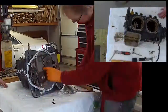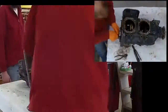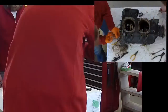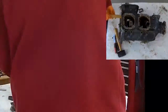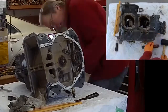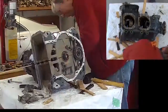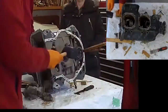Got the accessory case housing off, pulled a couple of little details off of there — just a little tap tap and it came off. Got the hidden bolt behind the cam and then the bolts on the bottom of the case, and then started splitting the case with cedar strips — the tapered cedar strips you use for mounting doors and windows. You can poke the nose in between, slide one in and tap tap, adding just a little bit of pressure without any hard surface on the case halves themselves. There's limited space at the front so you have to keep breaking the ends of the wedges off and keep tapping all the way around. Pretty quickly the case top popped right off.